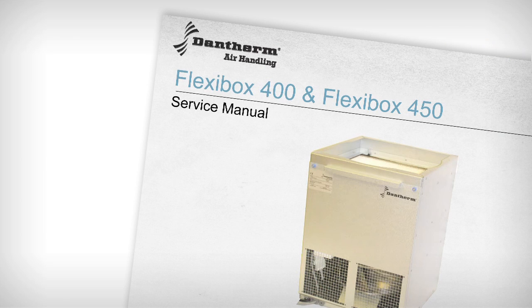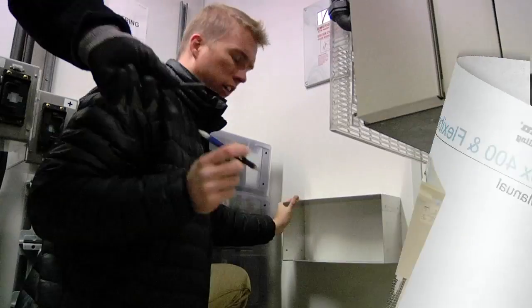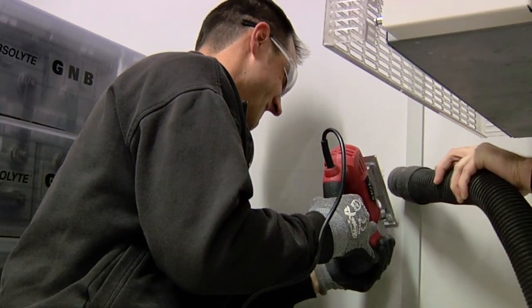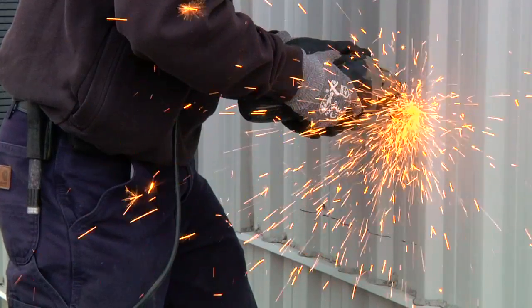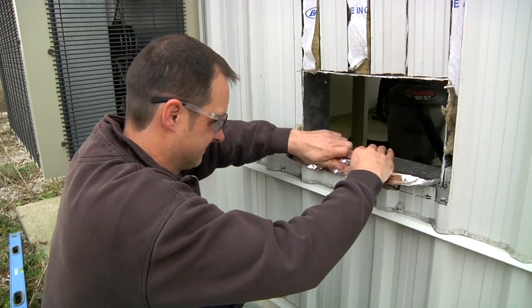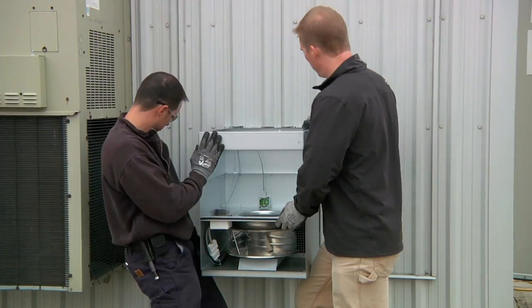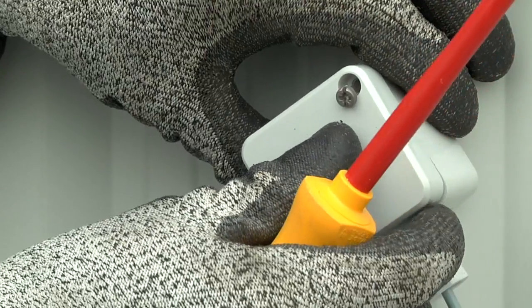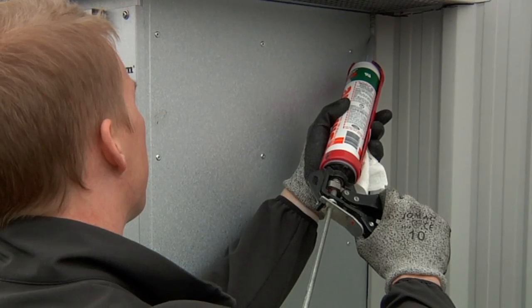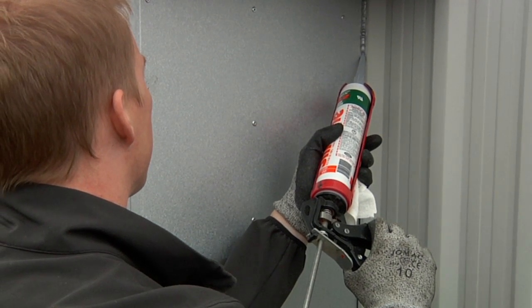Please refer to the installation manual and the site survey for the mounting height of the fan box and fan box rain hood. Use the provided wall insert to trace the outline for the wall cutout. Proceed to cut an opening through the shelter wall and be careful to avoid any hidden obstructions behind the wall. Place the wall insert in the opening and seal any gaps. Then run the wires through the opening and mount the fan box to the wall. Next, mount the outdoor temperature sensor above the fan box, then mount the fan box rain hood to the wall. Finally, check for any openings around the wall cutout and around the fan box and rain hood, and seal as needed.